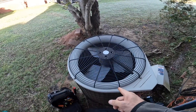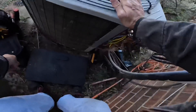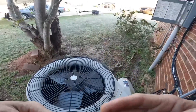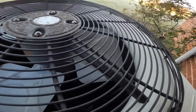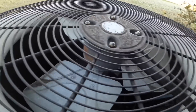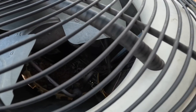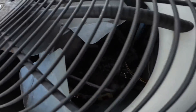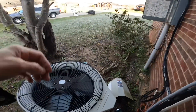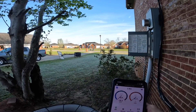Let's look for a leak in here first before we go digging into things upstairs. A lot of the times when it's just completely out of freon there might be something out here. I'm not seeing any oil spots. Let me see if I have any pressure on this now — that thing still says I'm in a vacuum.